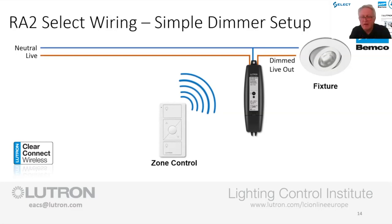So inrush current, basically. Because we're doing a soft start on this one, not quite as much. When I'm saying I would normally limit to 15 points in a lighting circuit, most people don't take it past that. The bit that I've had major issues with is when you start looking at LED tape and trying to dim that. The power supplies that come for LED tape, you can go onto the more common manufacturers' websites, I'll not name their names, and they actually tell you that you can't have any more than two power supplies on a type C 16 amp breaker. It was just horrendous. They are getting better, but